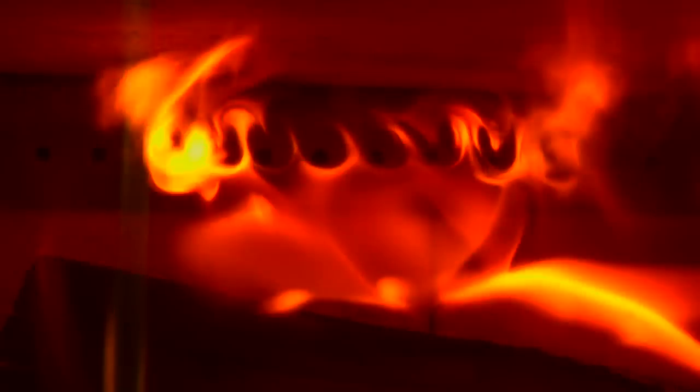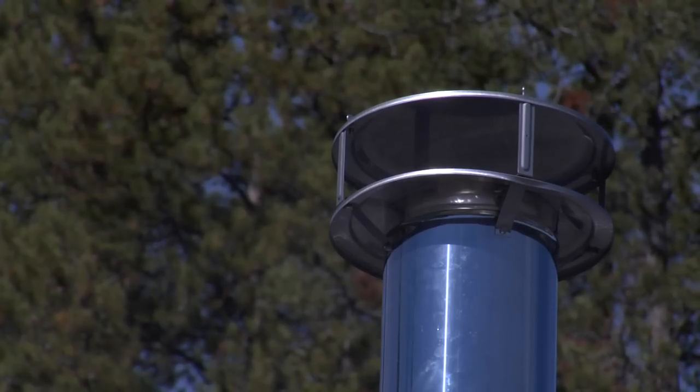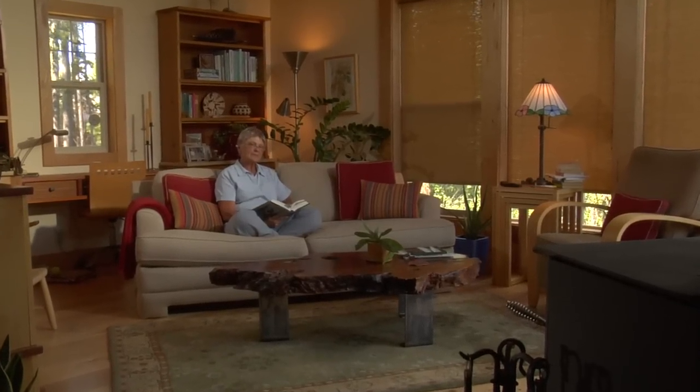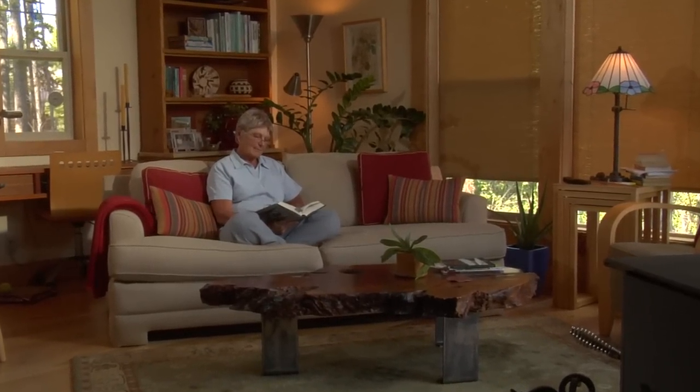These yellow flames indicate that the secondary air tubes within the stove have been lit. When you see that the tubes have been lit, you'll know that your stove is burning most efficiently, and that there is no smoke coming from your chimney. Some brands of non-catalytic stoves have a separate reactor chamber in the rear of the stove, and will not have tubes on the top of the firebox. Check the owner's manual for clarification.